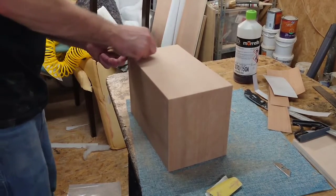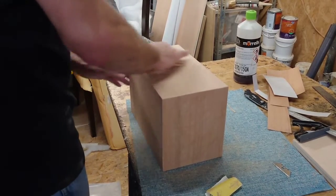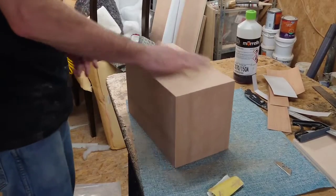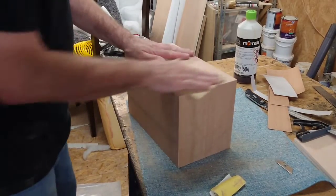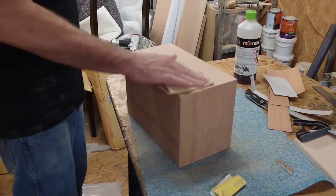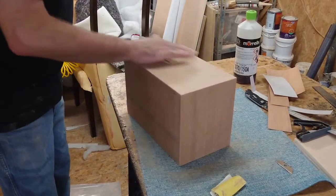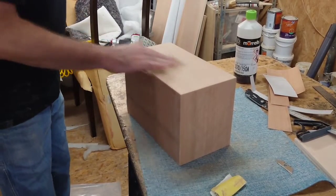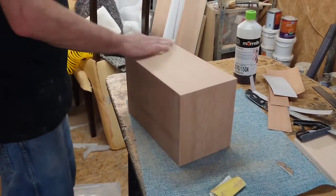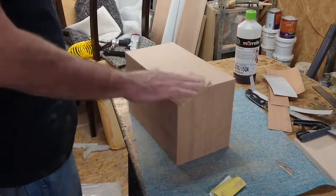Even though it says it's diamond hard, there is one which is a 2-pack polyurethane. That does work really well, but you have to mix a cross-linker with the lacquer. What happens is you only have a short period of time to get the lacquer onto the surface. It has a working time of about 10 minutes, I think, before it goes off. And if it goes off, all that will happen is you'll have a crazy paving effect on the surface.